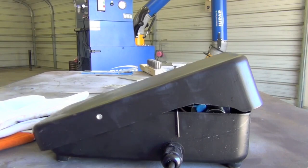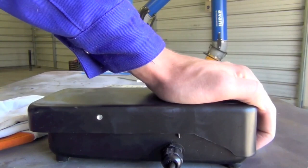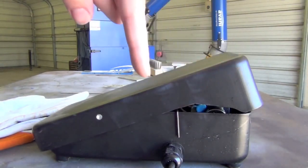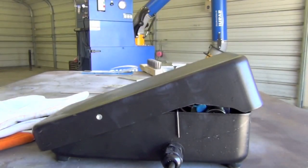To avoid the crater, instead of releasing the foot pedal entirely too fast, taper it off real slowly. You get bonus points for moving the tungsten electrode in little circular motions at the end - instead of the arc going straight down all the way through the weld puddle, it doesn't go as deep, making the void easier to fill. A tiny almost microscopic void is sometimes unavoidable, but leaving a huge crater is definitely avoidable. It's a really good habit to get into early on in your welding career.